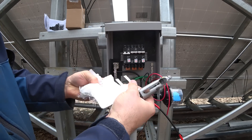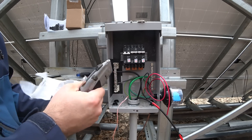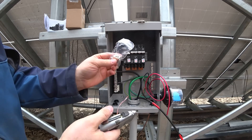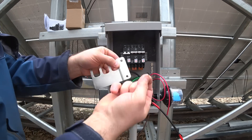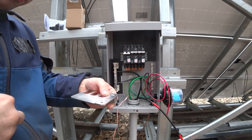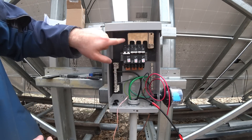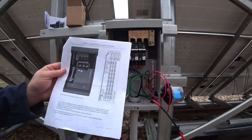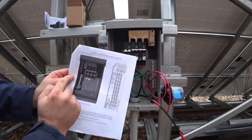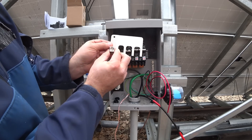It's a plated copper bar. There's a lug on here, and on the back side we have a little star washer and then the screw. Now you can see it combines all of them together. In the picture it actually shows the bus bar going to the left, so I'm going to switch that around. With that swapped around, I'll put this in.